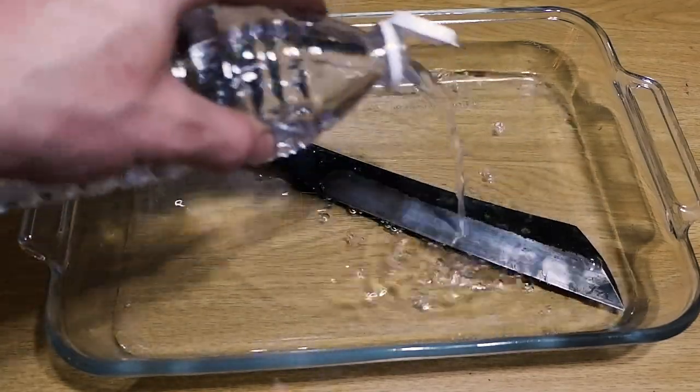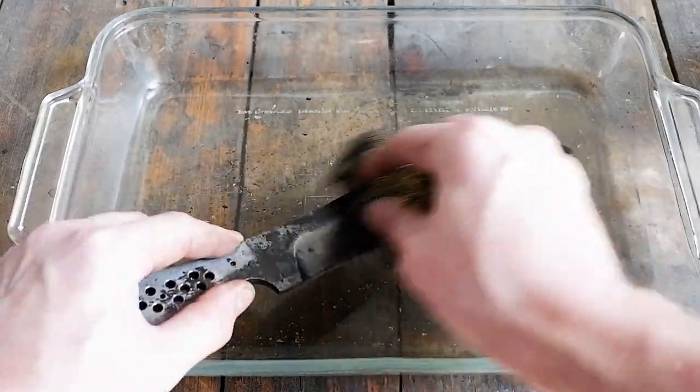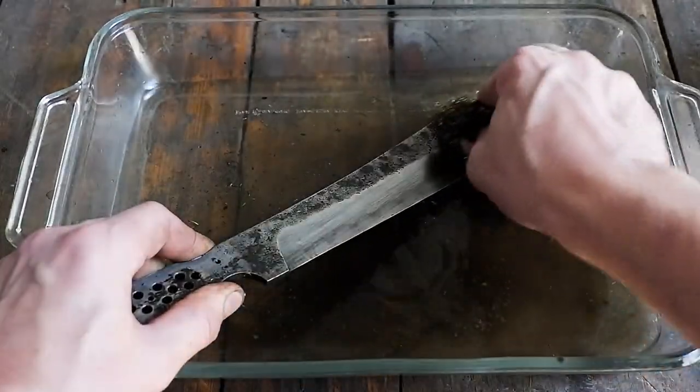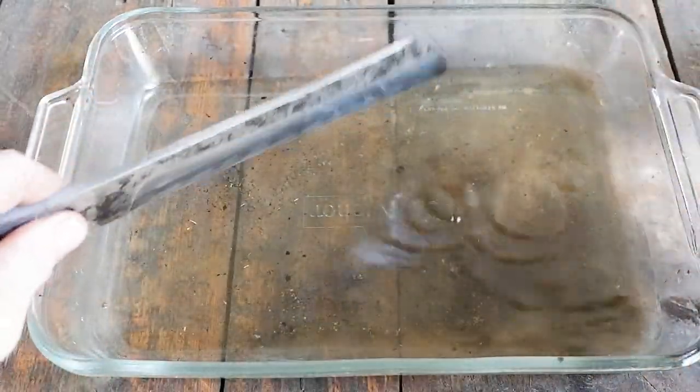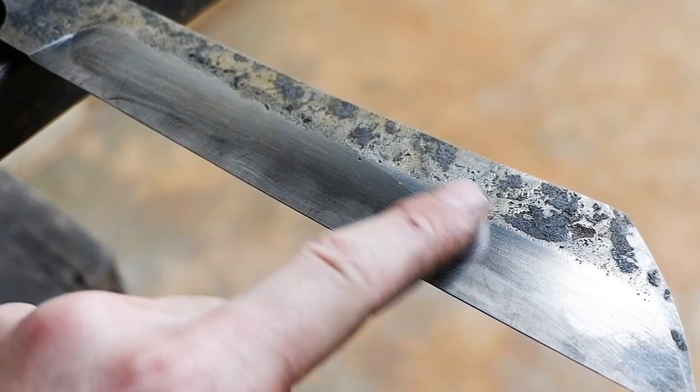Now that the heat treatment is finished, I soak the blade in white vinegar overnight to loosen up the excess forged scale on the blade. Simply scrub it off the next morning to reveal the rough texture of the forged metal. We can already see the hamon line that formed during heat treatment, but we will focus on that in more detail later.